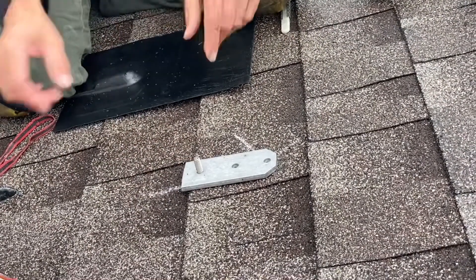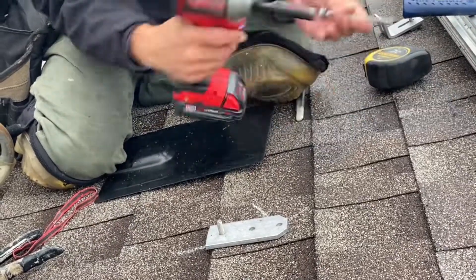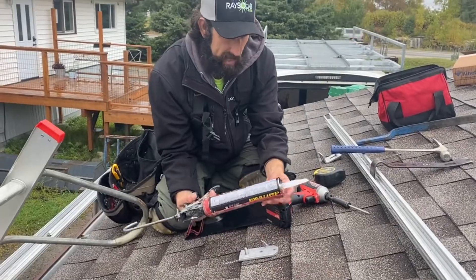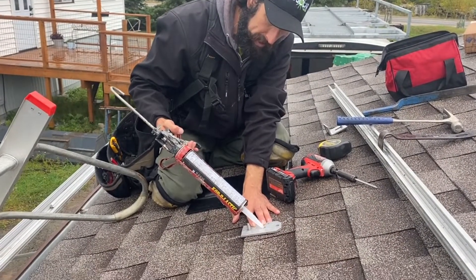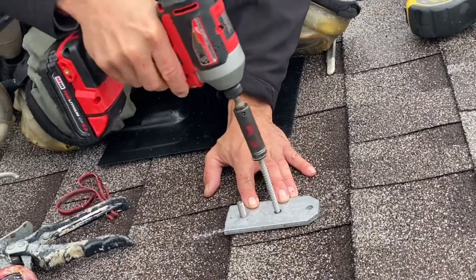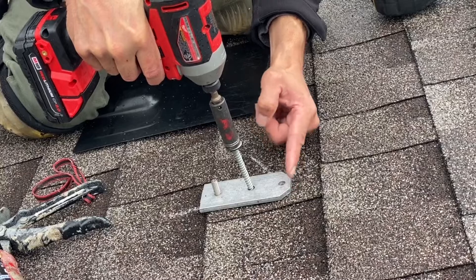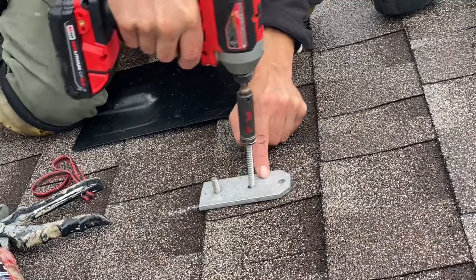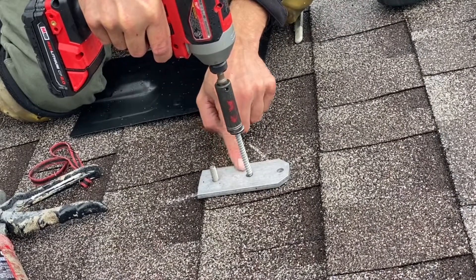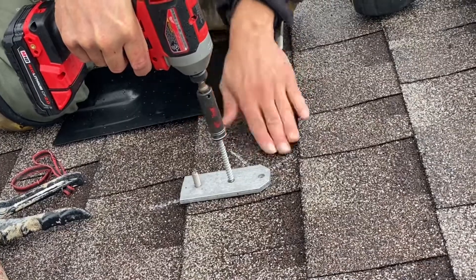I'm going to have an impact gun with a driver — this is the only way to properly do it, though you could use a drill as well. I'm going to have my screw and my sealant. What I like to do, even though this is all going to be covered up, is put a small dab of sealant in this first hole here. Then I'll take my self-tapping screw and drive it straight in. You've got to make sure when you drive this in that you're perpendicular to the roofing — it needs to be a 90-degree angle. You don't want to be on the side; you want it at 90 degrees so it sits nice and flush and fastens to the structural part of the flashing.